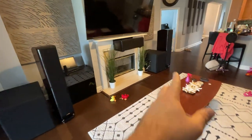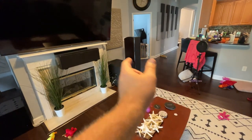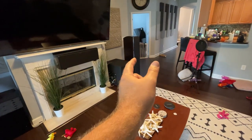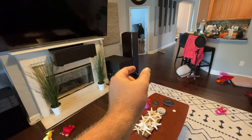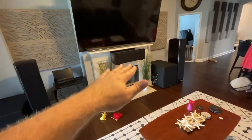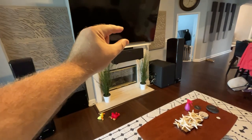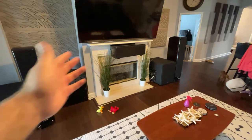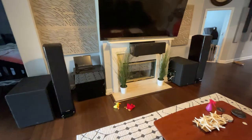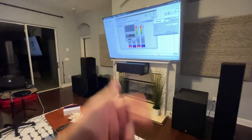What you're listening for is zero change in the image — it should sound like somebody walking across the front of the room. I've got a lot of testing to do. I lay down a track of tape for measurement marks and move it first an inch at a time to find nodal points, then a millimeter at a time until it locks and the speakers completely disappear when sitting in the sweet spot. Then I do toe-in. Stage height is already set — I have it set for a human singer at normal height, about six feet off the ground. Then I'll do REW and re-EQ the subs, then room correction through the AVR.